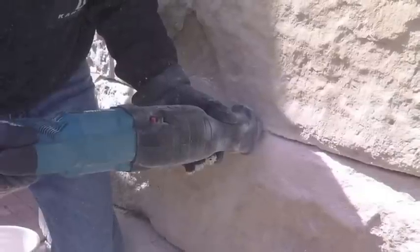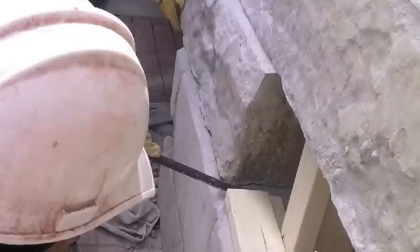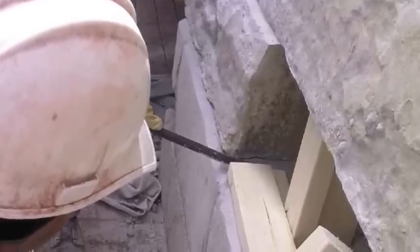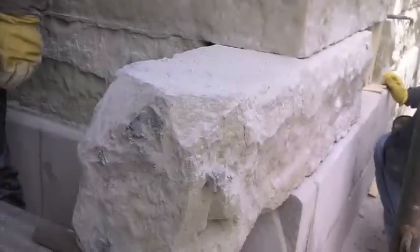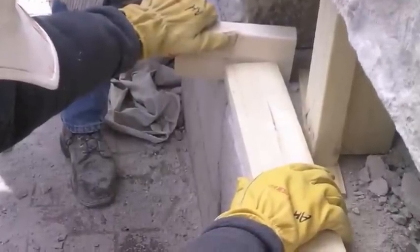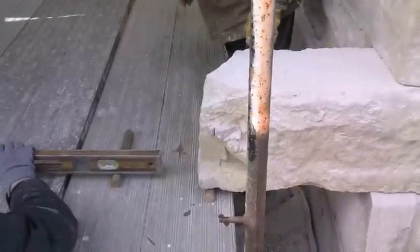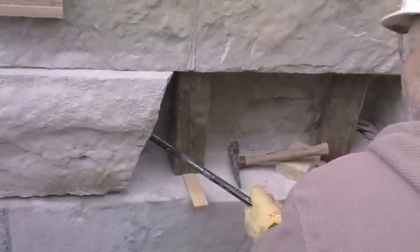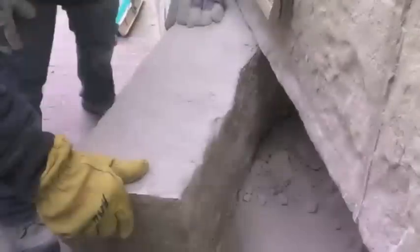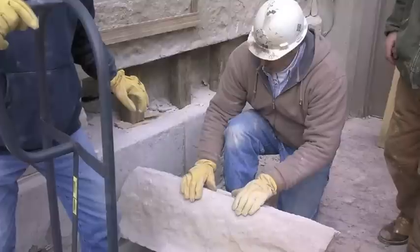The second day of training involved the full and complete removal of an entire piece of stone from the facade to facilitate a complete replacement of the stone in the same location. The work required careful removal of the entire units from joint to joint, without damaging the surrounding stone in a manner that permits the replacement with full-size units. Supports were required to protect the remaining stonework that surrounded the removal area.